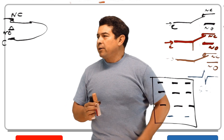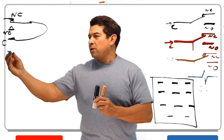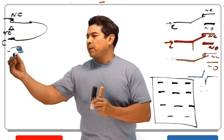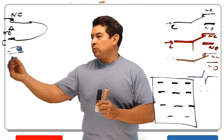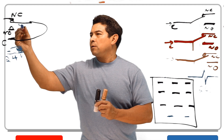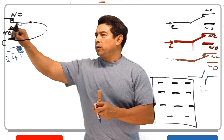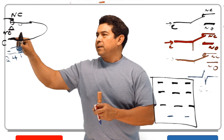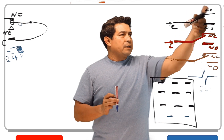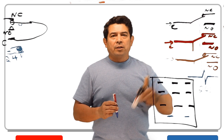Because what's going to happen is down here at the bottom, we're going to have a coil. We have a connection here, and all it is, is just a wound up coil. Once we put 24 volts to this, then this is going to reach up here and pull this down. Once it pulls this down, then we're going to make contact between this contact here and that contact there. Once that happens, it's just like taking this and moving it down — we have made contact from common and normally closed down to common and normally open. That's what's going to happen on the relay.